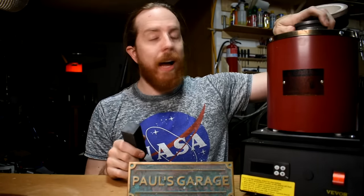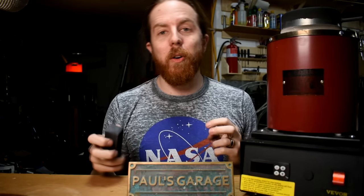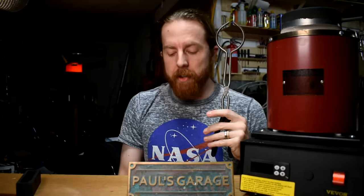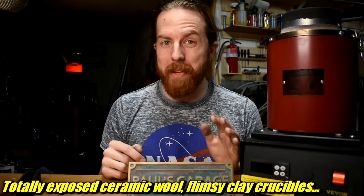See, it's all coming together. I recommend if you're new, start small. You don't want to be learning new things while holding six kilograms of molten bronze on the end of crucible tongs. This is a very good kit because it comes with the furnace, two crucibles, tongs for the crucibles, and leather gloves. There are propane kits that come with similar stuff, but then you have to buy propane, some don't come with burners, and the tongs are kind of miserable. The electric ones are just easier.